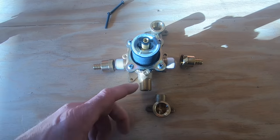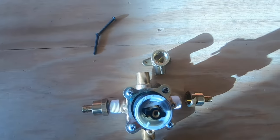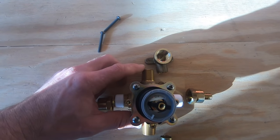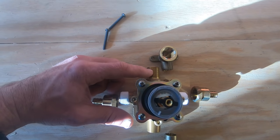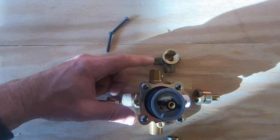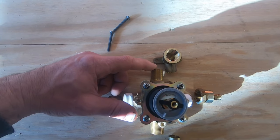What I like to do is run half inch copper down and also half inch copper up to the shower head, because that allows more water up to the shower head. The PEX is under half an inch and the inside diameter of copper is actually a little over half an inch, so you're going to have a little more flow going up to your shower head.